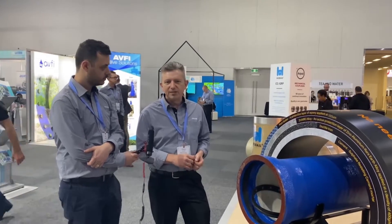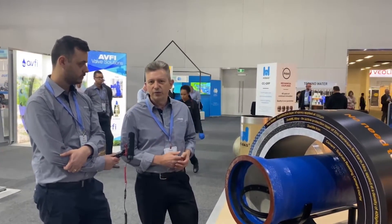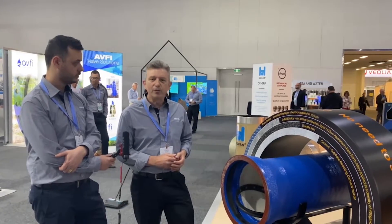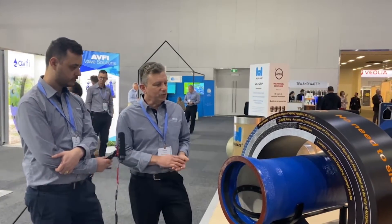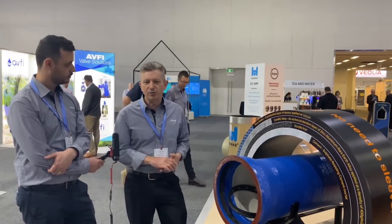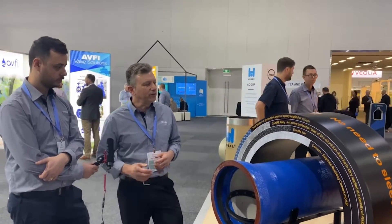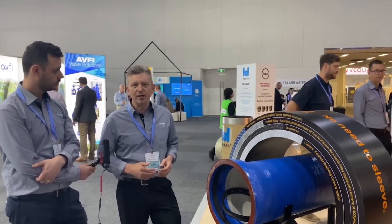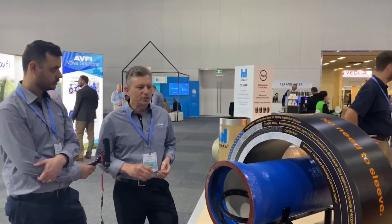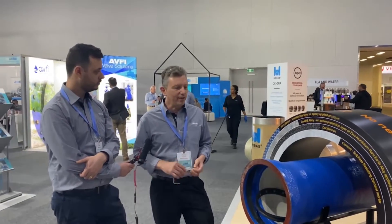It is quite a unique coating and enables this ductile iron pipe to be buried in the ground without the requirement for polyethylene sleeving in most soils. For our customers, we provide a service which includes soil testing to make sure the soil is compatible with the pipe, because it's all about the customer's asset and design life — we're looking for a design life of 100 years, so we do some checks that we can carry out ourselves.